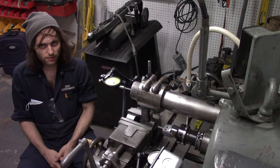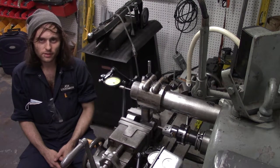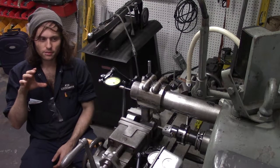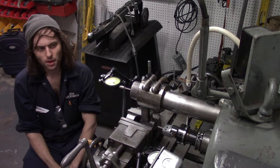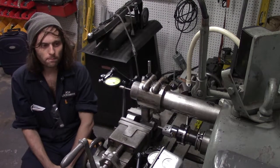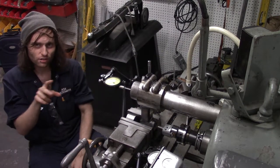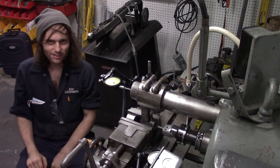Here is where the accuracy of this part really is determined. The whole idea is that the Arbor Support now is exactly where it will be as far as it being clamped to the overarm and being directly in the path of the mill spindle. The mill spindle ideally will take out any deviation in concentricity when it bores it. So let's get on with it and get this thing done.